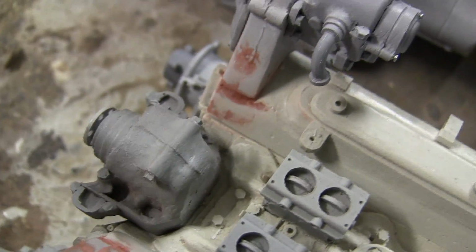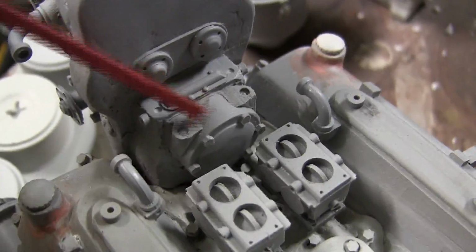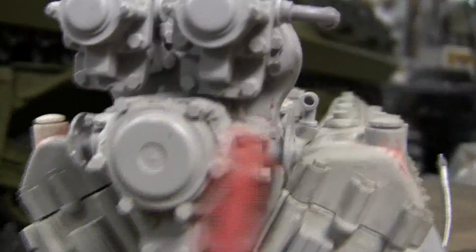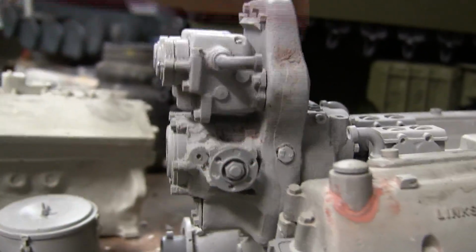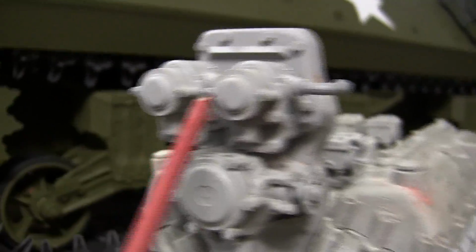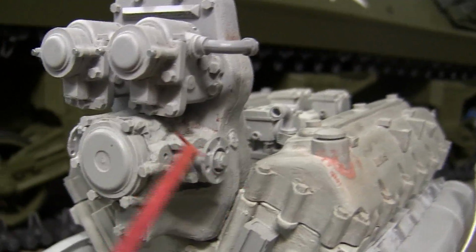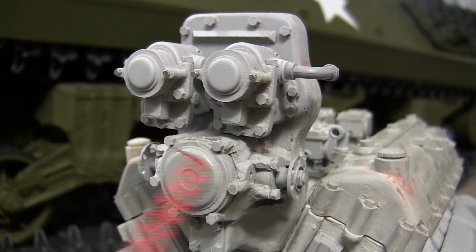First, the gearbox, which over here back on the 210 was a small little self-contained unit, while on the 230 it was added in complexity because of the magnetos. The 230 has a very large tower projecting from the center of the engine. As we discussed earlier, over here are the two magnetos side by side, and over here, this is the access panel for the gearbox that turns the fans.